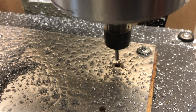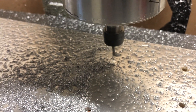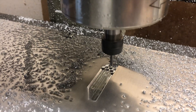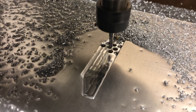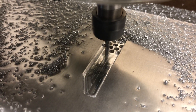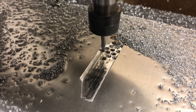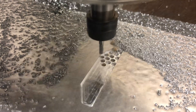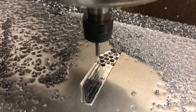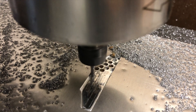The guy here in Australia that I buy my CNC bits off suggested I try using isopropyl alcohol instead of WD-40 as a lubricant for cutting aluminium, and it's absolutely changed my life. It's incredible. As it flashes off, the alcohol cools the metal substantially — it gets ice cold — so it does a better job of cooling than WD-40 ever would, and it leaves no mess. The alcohol just flashes off and you have no greasy or oily film left on anything, so that's really good if you're going to weld it — you don't have any oil to clean up.